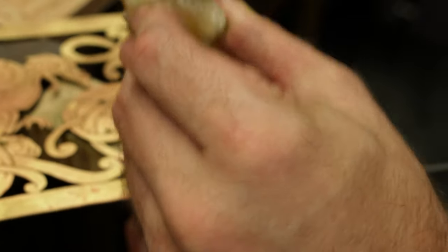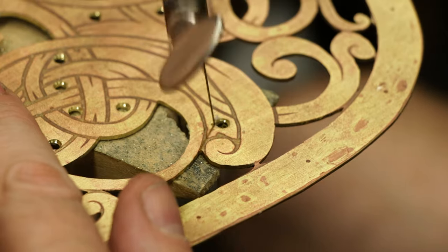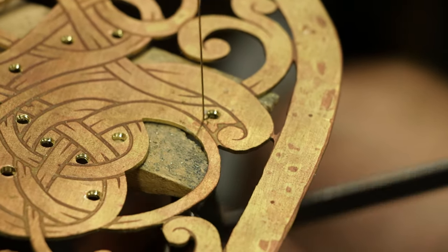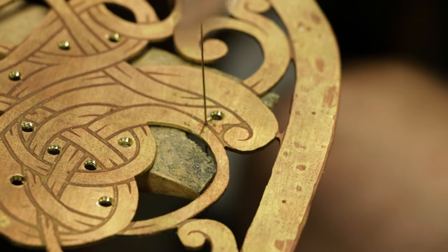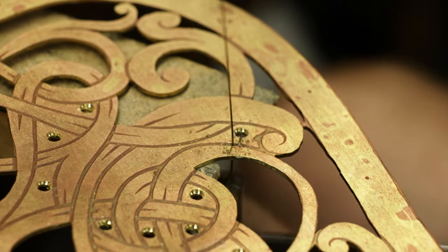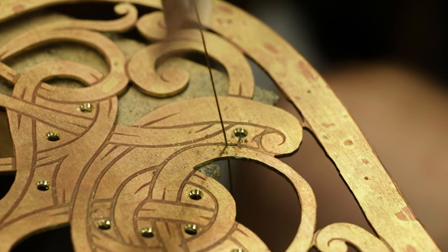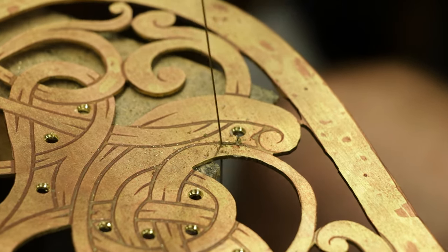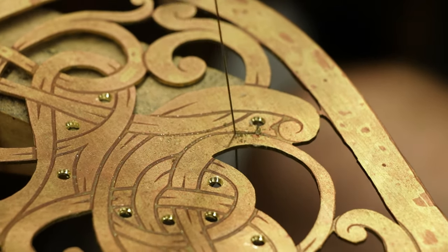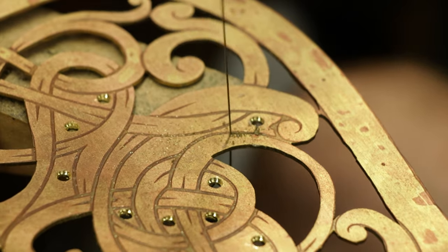And now you're just going to begin to saw your way through your piece. Don't use a lot of pressure. You don't want to be replacing broken blades all the time. As I said before, keep applying beeswax. If you get to a corner, slowly saw up and down in that corner without any forward momentum and turn your blade. So you're going to just slowly saw your way into the next direction.